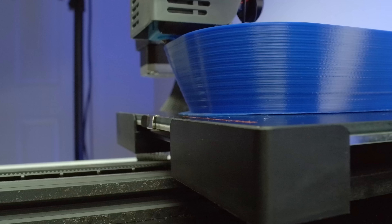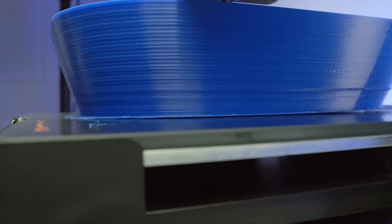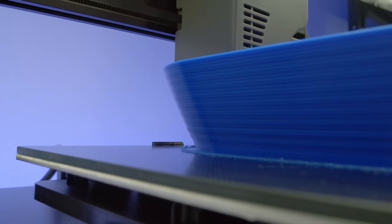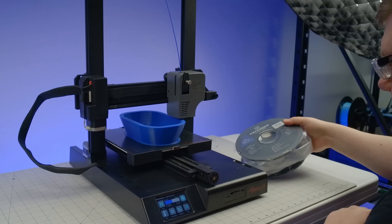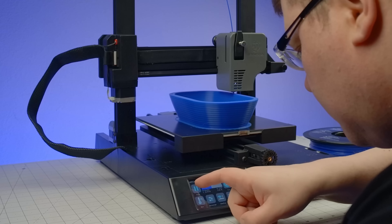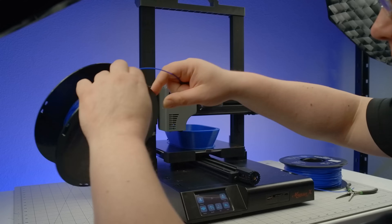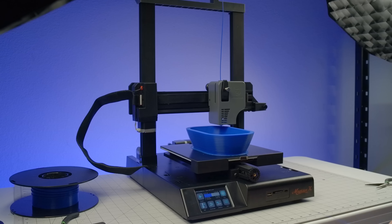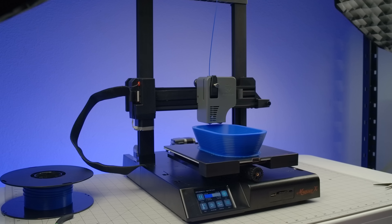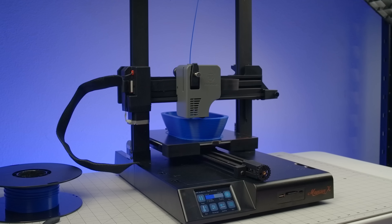What's more, despite the freshly cleaned and re-leveled 80-degree print surface, the model has once again detached in the exact same manner, in the exact same spot, though I'm still inclined to let it ride as I did with the lower half. This also means it's about time to load in some more filament — and to the machine's credit, that part is simple: we hit pause, the extruder parks, we retract the old filament, change spools, feed in the new filament, and off we go. At this point I'm just going to wish it well and leave it be, realizing that with all the noise on the Z axis, it still remains to be seen whether or not the tongue will even fit into the groove.